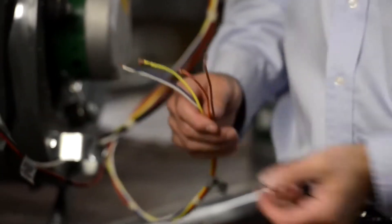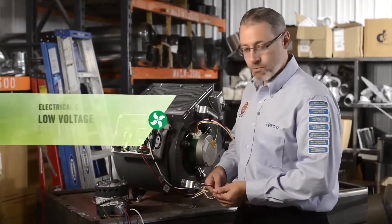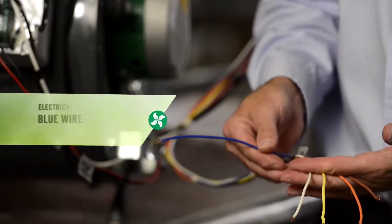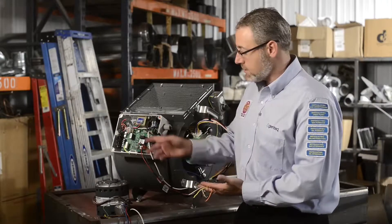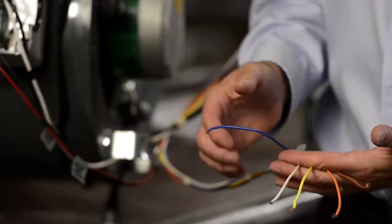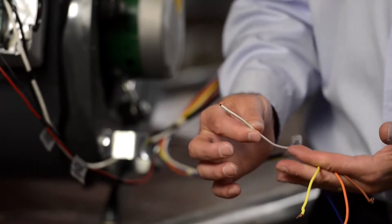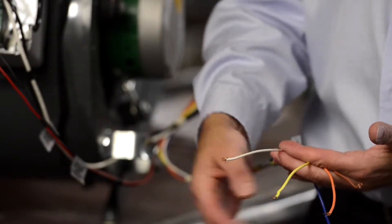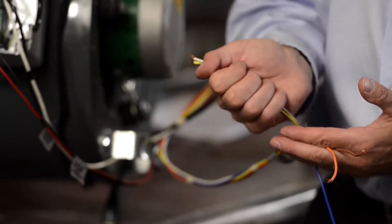We've already disconnected all wires off the PSC motor and connected two of the three harnesses. The last harness is the low voltage signal harness — these are the speed taps of the Evergreen IM motor. The blue wire is a 24-volt common wire. The other four wires are our 24-volt speed taps and we connect those to the thermostat connections. For example, the blue wire goes to thermostat common. For low speed for heat, connect the white wire to the heat terminal, usually labeled W. For high speed for cool, connect the yellow wire to the cooling wire, usually labeled Y. When done, tape off the other two unused speeds.